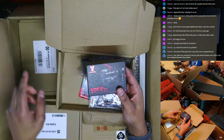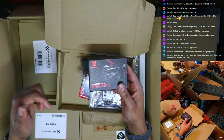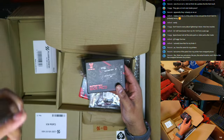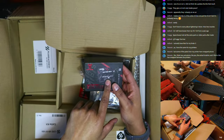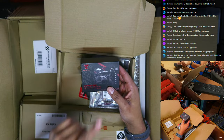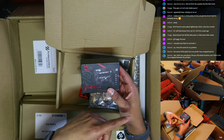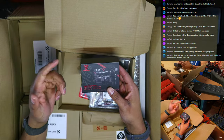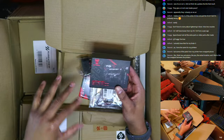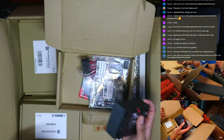One thing that's kind of cool about this kit is that it uses the Picbilical, which is basically an extra MCU up at the frame and toolhead, like the umbilical, but it gives you some IO back on your SKR Pico. So I think you get at least one fan port back, or maybe two, so you can power something like a Nevermore, and you get some IO back, which is nice because maybe you won't need a Klipper expander if you are able to get enough IO out of this.